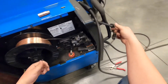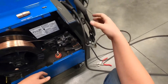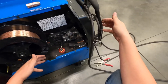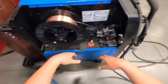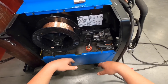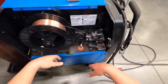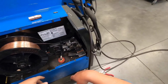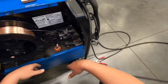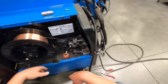To complete the circuit — just like a car battery — your ground needs to be hooked to either the work table or whatever you're welding on, otherwise you won't complete the circuit. We'll talk more about that during the demo on your first welding assignment. This covers the internal parts of the MIG welder. If you lose your notes or forget something, check the dumb dumb card — look at those pictures before jumping to conclusions. Use critical thinking and check the dumb dumb cards.